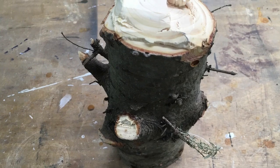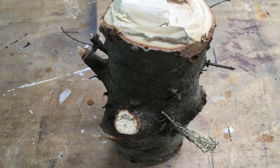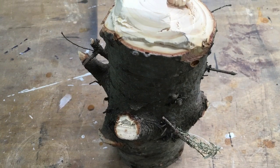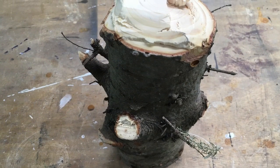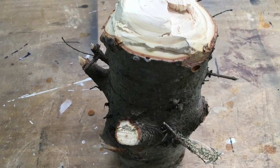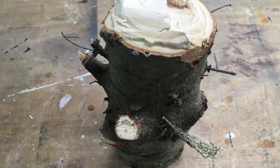To begin with, this is the wood that I'm using for this project. It's the leftover from a Christmas tree — this is the trunk of a Christmas tree and we're going to cut it and make this into the project. I'm not going to show you all the steps, but basically we just cut it on the chop saw into thin slices and then put it in a small toaster oven at about 200 degrees for about two hours to dry the wood.